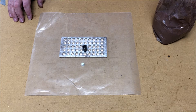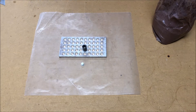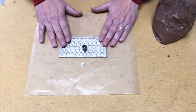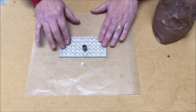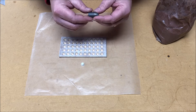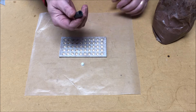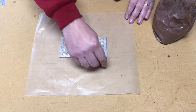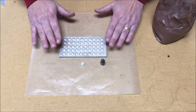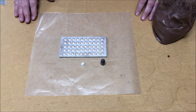Then they settled on a boxwood plug, and the final variant of the cartridge used a clay-fired plug. In previous videos we've experimented with the plug plate that comes from Noe bullet molds. This was cast from a Noe mold for their Boxer variant of the Enfield cartridge bullet, which is 0.550 inches in diameter.